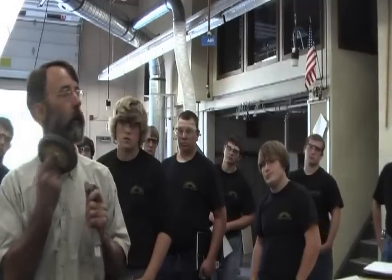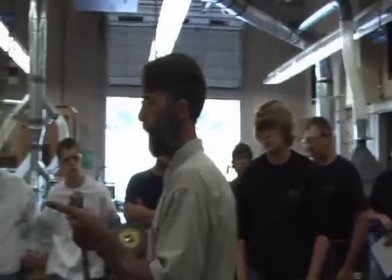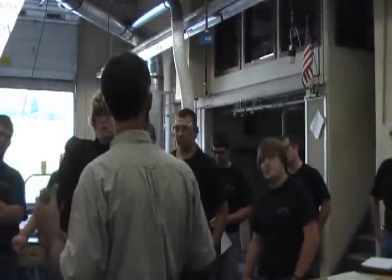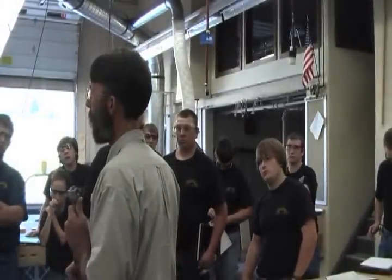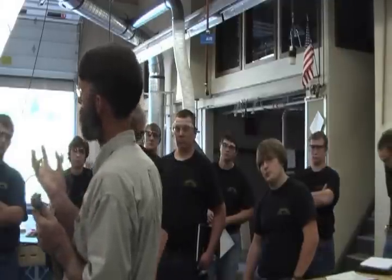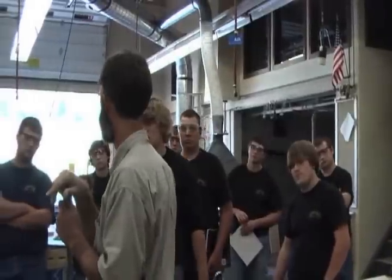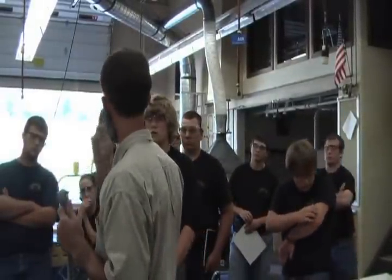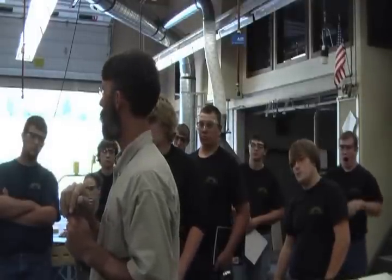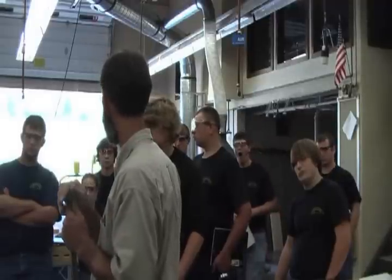But I kind of like what you were looking for. They do have an industry, all kinds of large wheels and small wheels and grindstones. And some of them they use grinding gears. The finest finish you can get on metalwork is going to be a ground finish. Those are the mirror finishes that you see on metal. Unless they buff it, they can get a ground finish and be accurate to fine thousandths of an inch or less.